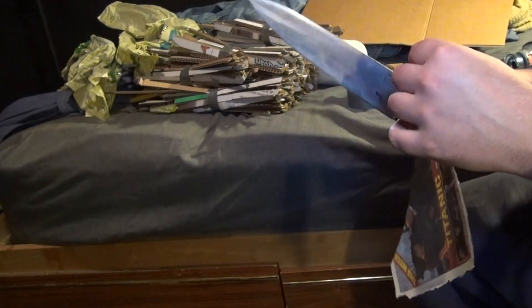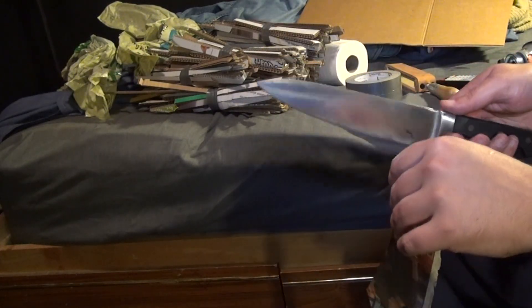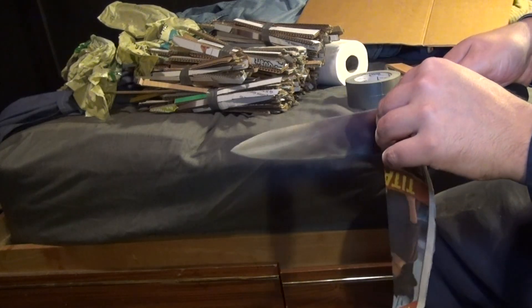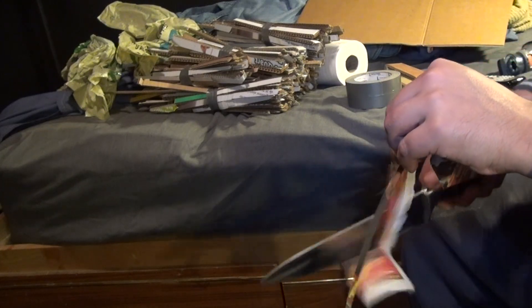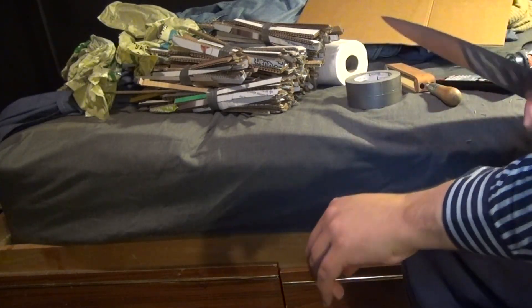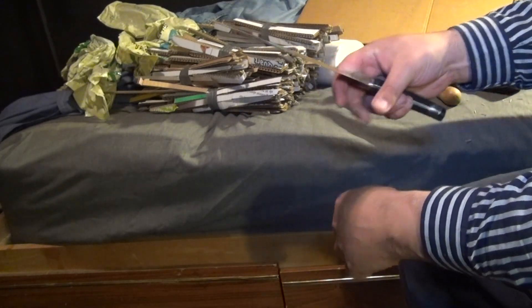You can see how easy it is to get to a decent level of sharpness — this was done with a cheap bench stone loaded with a 200 grit water stone, essentially just to speed up the process. Without that 200 grit water stone it would literally take ten times as long on that bench stone because it cuts so slowly and loads so rapidly. A quick demonstration of just how easy it is to get a knife to a respectable level of sharpness.